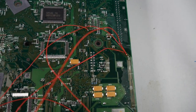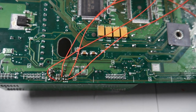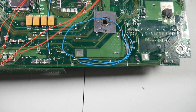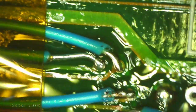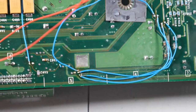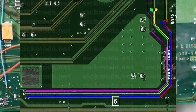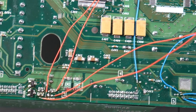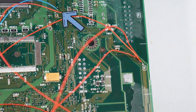The blue wires were actually a lot easier to do in comparison to the red ones — I had bigger pads to solder onto, which made the process a lot easier. I did four here along these traces and I'll try to have diagrams left in the description. Then one more slightly to the left, which is a little longer but goes all the way from this pad to this pad.